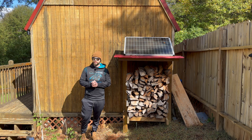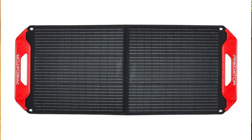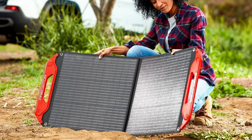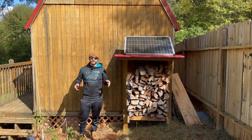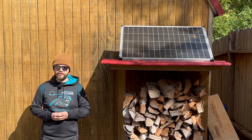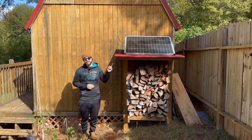Let's talk about solar panels. There are really two types you're going to see when shopping: ones that look rigid like this, and the flimsy little folding kind. The rigid kind is what you're going to want to buy. The folding kind is made for more temporary setups — like camping when you just need to recharge your phone for a couple of hours. It's not made to leave out in the weather for months or years at a time. The rigid kind is. I've had this one sitting here for about six months and it's endured hurricanes, tornadoes, hail, and thunderstorms and it's perfectly fine.